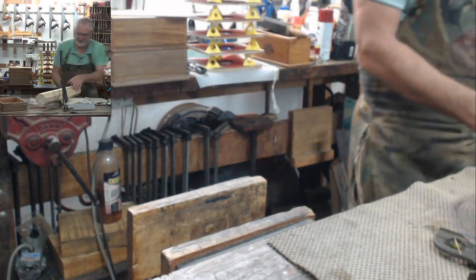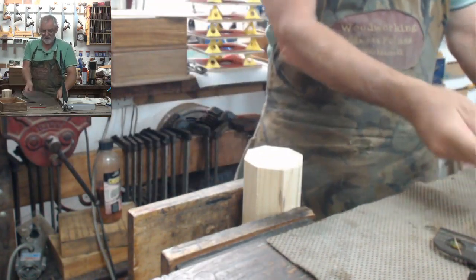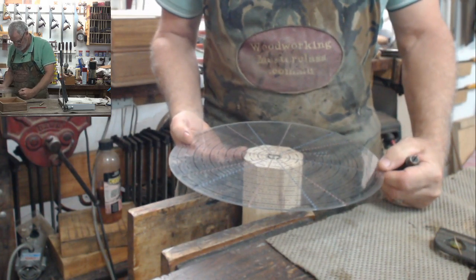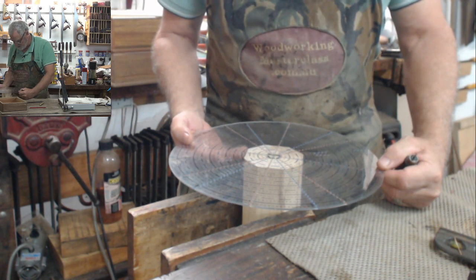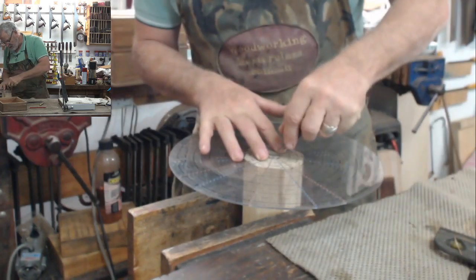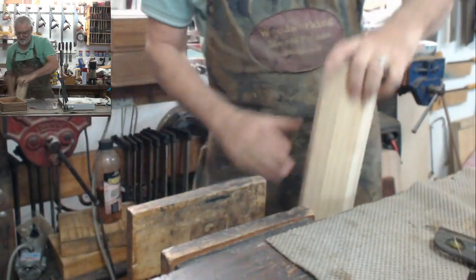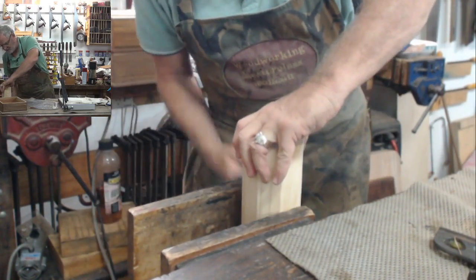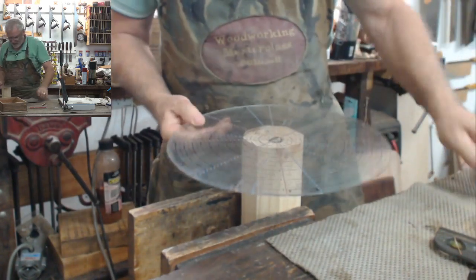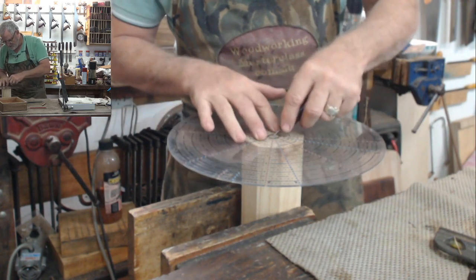And the lucky last. You find that if you've got a great big lump of square timber to turn, if you've got a table saw, or even if you've got an electric plane, just knock the corners off. It makes it so much easier when you're turning. Number one, it's a little bit more in balance, but also you do reduce the risk of getting great big shards of timber coming off, which isn't very nice.